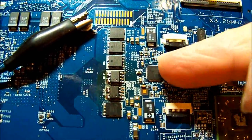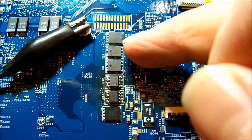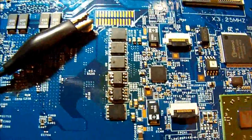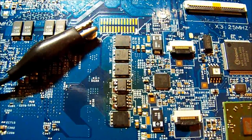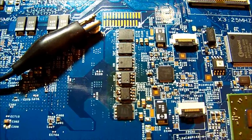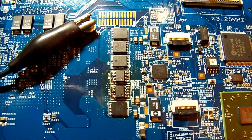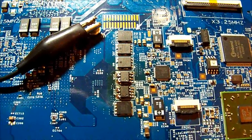Well, that's the weirdest thing. I could have sworn those outer two FETs were okay - I was getting one minute a shorted reading, the next minute an okay reading, and I don't quite know what's going on there. But they appear to be shorted at the moment, which is holding the whole thing up, even though we have our gate drive signal back. They are on their own phase, and the gate drive signal to those ones is a bit fuzzy as well. I guess the next step is just to pull those off and switch them - back to the hot plate.